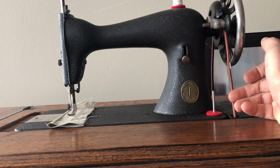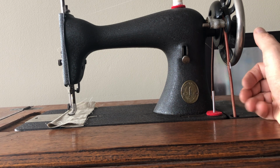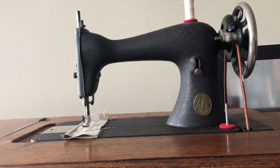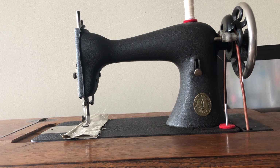And again, some of you may have your preferences. You may prefer a treadle belt with more tension. But once you get your belt settled and you've pre-stretched it, even if you have to take it off and readjust it once more, I did not have to with this one because I used the rosin. But whatever method you use, once you have gotten your treadle belt sort of seasoned, if I can use that term, basically that's it. And other than oiling, there's really nothing else you need to do.